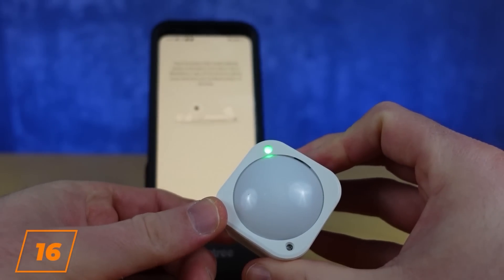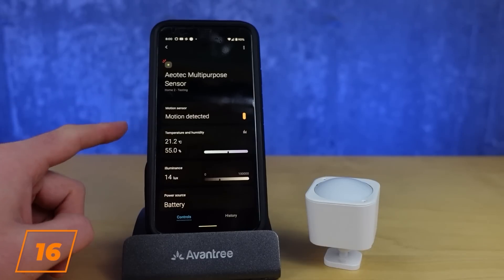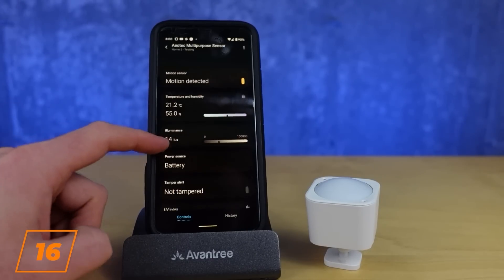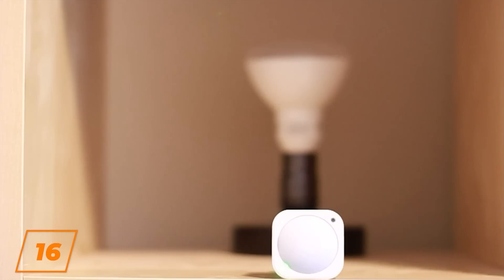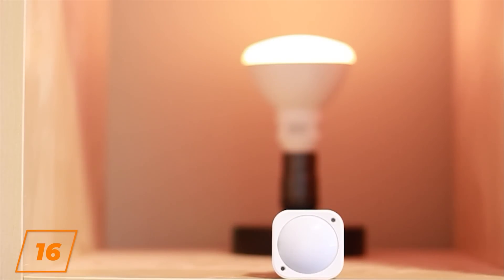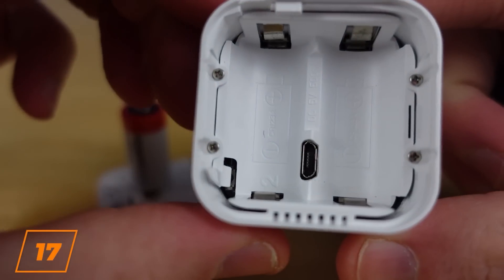While we're on the topic of a sensor's response time, there are a few things you can do to help your sensors perform better. Each multi-sensor that you purchase is great for your automations from the standpoint of getting extra information, but it can slow down the response time of the sensor on things that you want brought back immediately. I've seen this with multi-sensors that are trying to sense things like motion as well as a number of other things, and then seeing that motion response takes extra time. Watch for it when you get three to four sensors in one device.